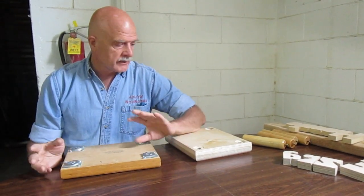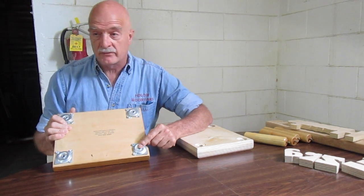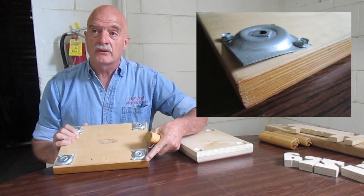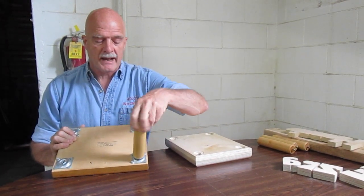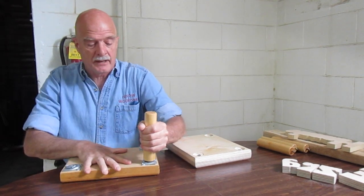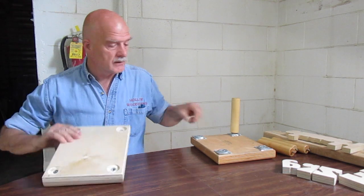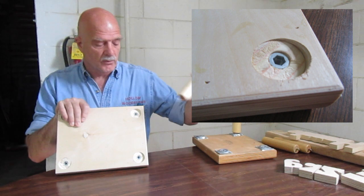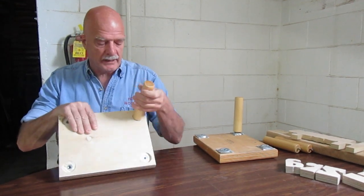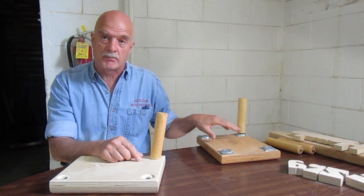The second reason we recommend our products is, believe it or not, the back of the stool where the leg plates go. All of our competitors still use leg plates like this, and we did for many years until we came up with what we think is a better idea. With this particular leg plate, the corners turn up when you screw the leg in — it gets tight and pulls up instead of the leg going into the wood. When attached that way, you still have a lot of play because the leg is not directly attached to the stool; it's attached to the metal. Our idea, which we've been using for many years, is that we actually drill into the back of the stool and put an insert in there. When you screw the leg in, the stool leg goes all the way tight up against the stool so the leg can't move, because it's connected directly to the stool instead of having a metal bracket in between.